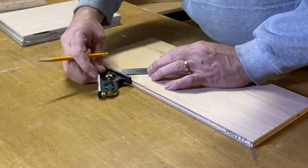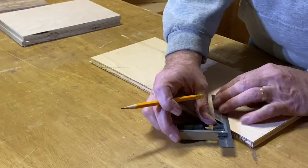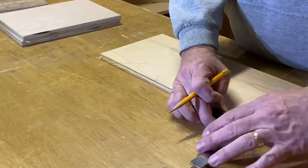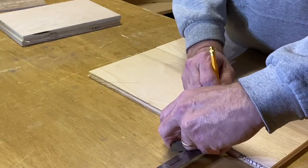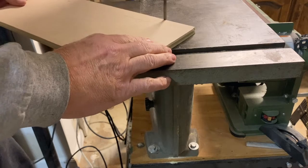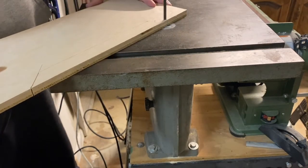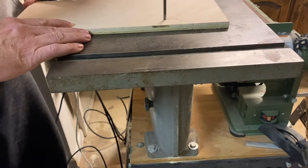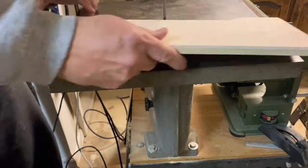Then I just take the pieces I've cut. What I like to do in this type of situation is make a little hand pull-out. So I just measure in — I think it was maybe three or four inches from each end — an inch down at a 45-degree angle, and then I just join the lines. Then I take it over to the bandsaw and just cut out those notches. It works out really, really well. I did this for both drawers in the bottom.